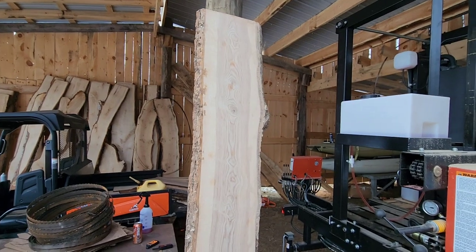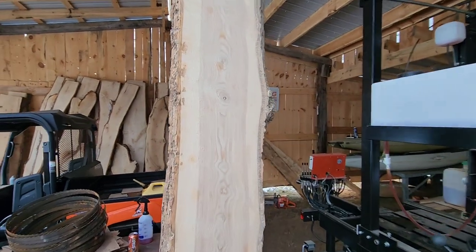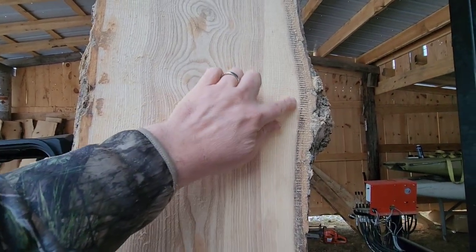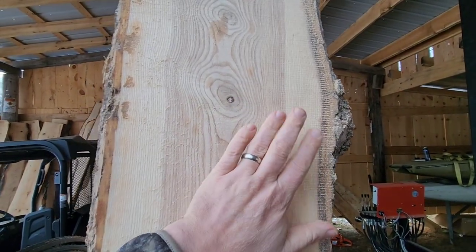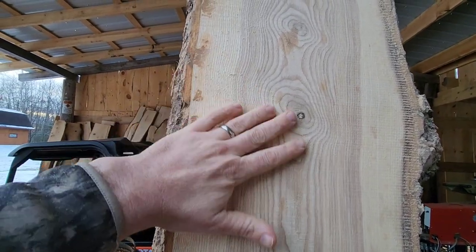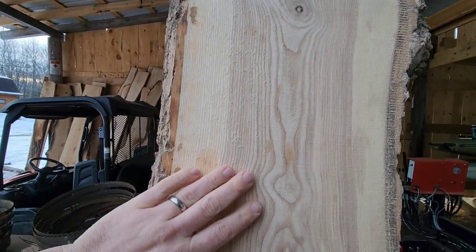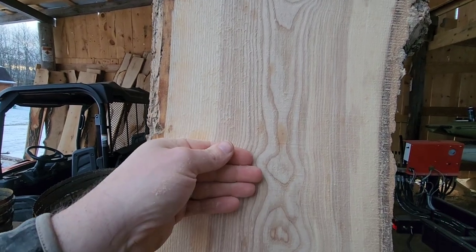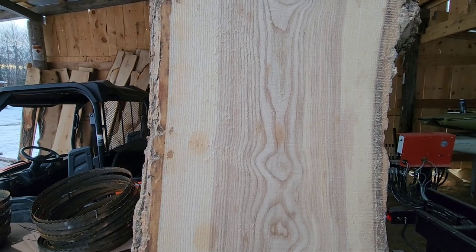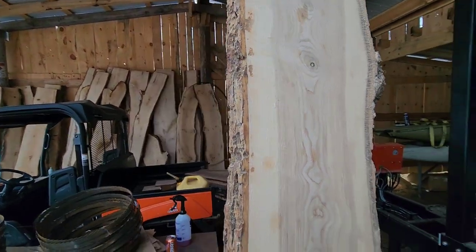Okay, folks, it cut up very well, but something I'm finding out, when the log's frozen, so you can see I still have, looks like I have a tooth that's a little bit raised up, but I think that is also dealing with the frozenness. I'm getting like this rip-out material going on here. So it's kind of like raised grains, but this board is absolutely freezing. I just had to knock the sawdust off here because it was freezing back to the board itself.